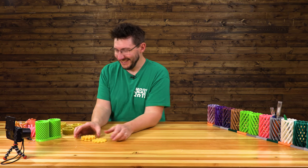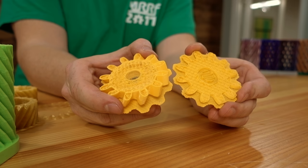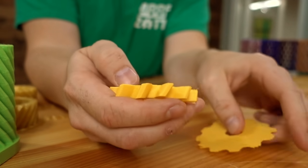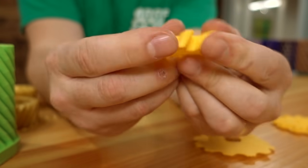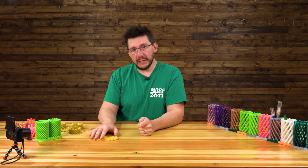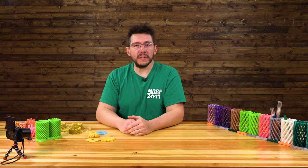Finally, look at this. I was trying to print these on the YAN from Furling Tech — you know, the thing that looks like the Obsidian, that looks like Polaroid, that looks like the Wanhao, that printer. I tried printing on there and if you look, it's super thin — it just bends. This one I did a whole bunch more perimeters, but the space between the raft isn't good and it's almost like a sponge cake. I don't think I'm extruding enough filament. I think I either need to slow the speed down or increase the multiplier. The default Cura profile they gave me has 102% flow rate which should work, but it didn't. Sad.